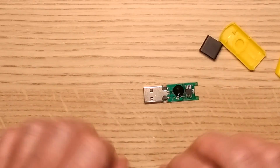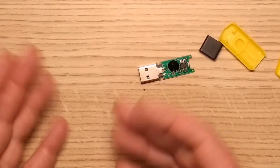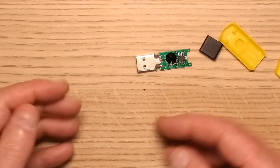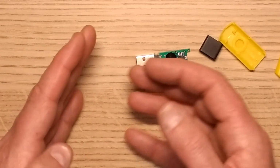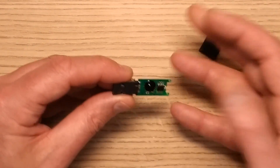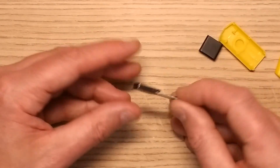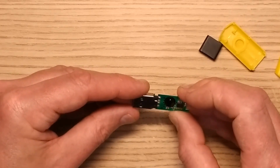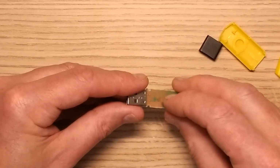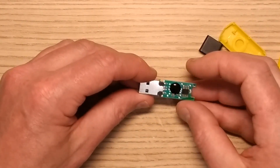Whereupon the rubber ducky executes keystroke commands at very high speed, and it could access your command line interface. It can open up ports for a hacker to access your computer later on. It can send out information by direct commands for sending your files to a remote location, or it can store them back on the card, or it can directly load in malware as just raw keystrokes. It can put malicious script into the computer and change configuration settings.